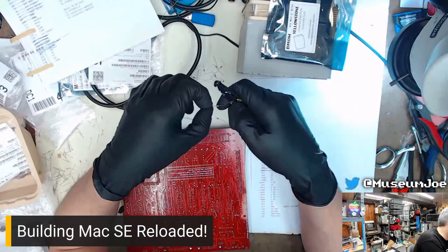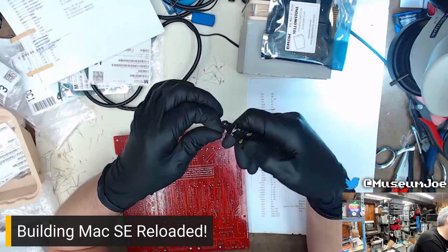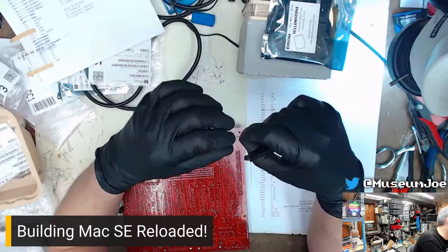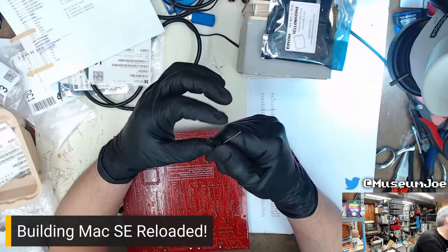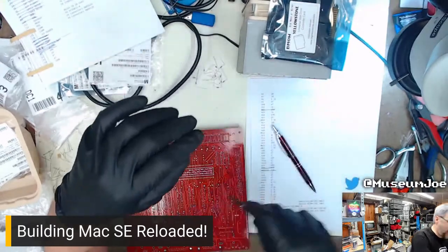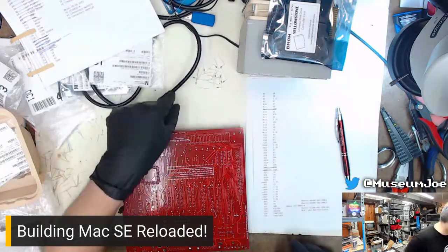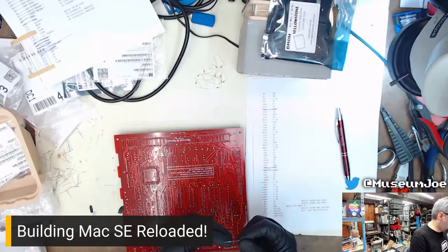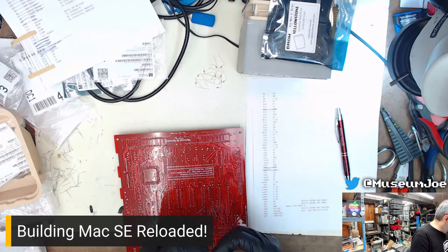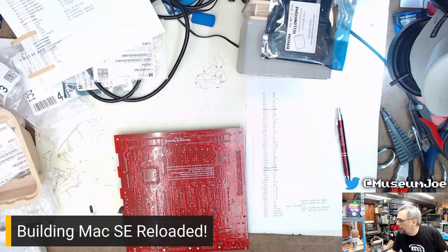video output. Right now, you can only talk to the thing over a serial console, and that's okay. That's fine. But that's kind of poopy, right? I want real video output. And I started the design of a composite video output, or NTSC video generation output, for it with 256 color support, which is really cool. But I'm not sure if I want to stay with it that way, or if I want to design a VGA solution that's a little bit more universal. I don't know.